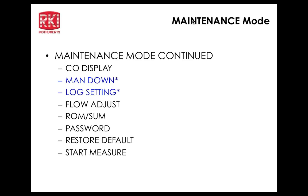It would give you a better setting. The problem with blocking the flow is that now you've got basically the most insensitive setting for the low flow. So you could have a pretty low flow that you wouldn't realize unless you actually looked at it with a flow meter. So it's better to have it a little bit above the absolute no flow from a safety standpoint. But we can reset it if it's causing a flow fault that way.